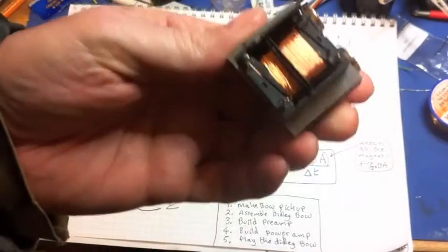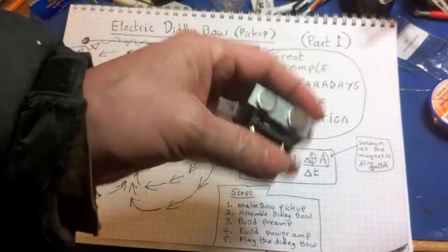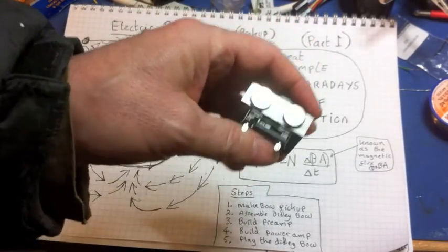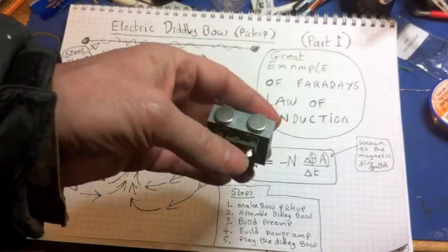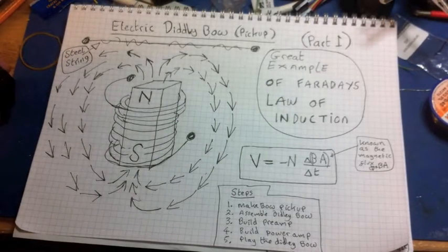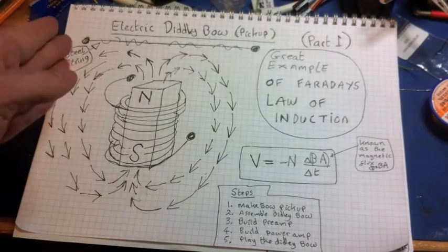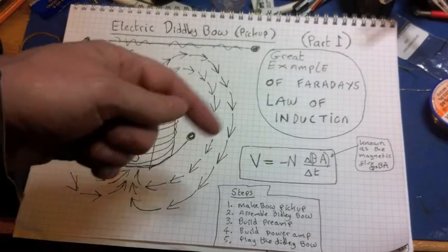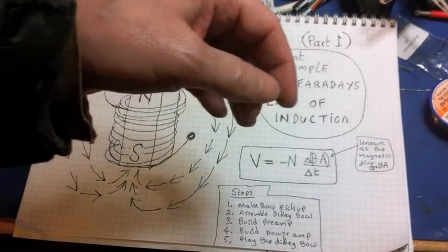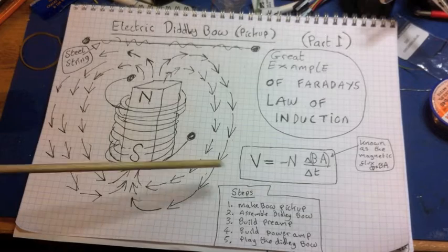Basically what we're going to be looking at is what's called Faraday's Law of Induction, and that will explain how this works. Faraday himself just came up with a law — a description of what happens — but there was never any explanation of why it happens. What he did was he had a length of wire, and he noticed that when he moved a magnet near to the wire, you could measure a voltage difference between the two ends of the wire. So it seems that when you move a magnet close to a wire, charges are induced — they call it induced current — and the charges are forced to move along the wire.